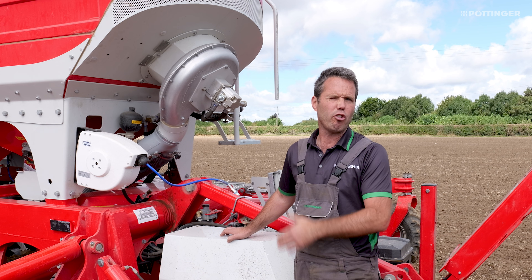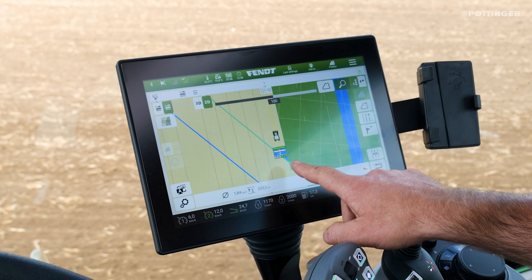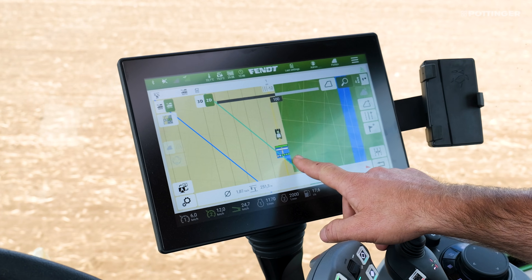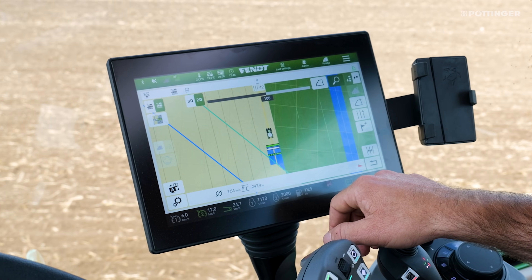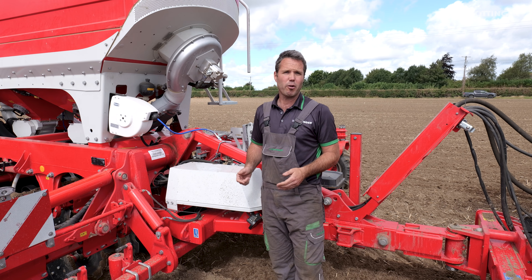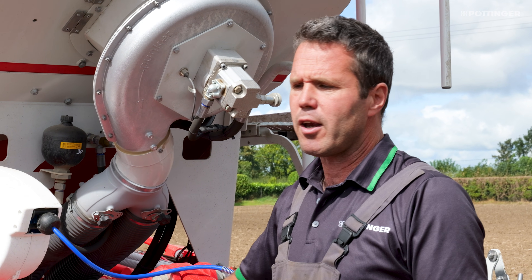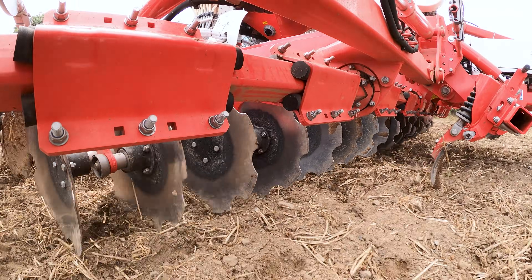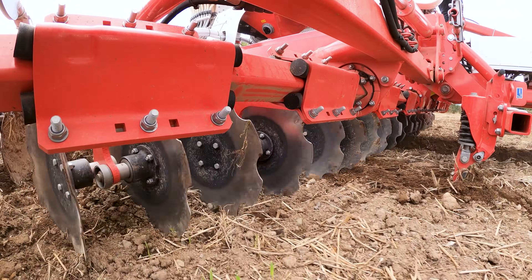This machine has six sections on the seed, so the seed or fertilizer can be shut off in six sections. In addition, the tractor can lift and lower the machine with section control, so on your headland ins and outs, you don't have to do anything — once you hit the boundary, the tractor will lower the cultivation discs and the seeding automatically.